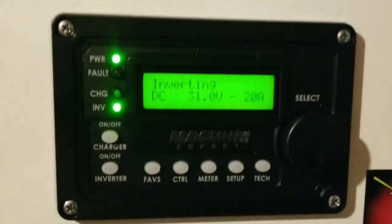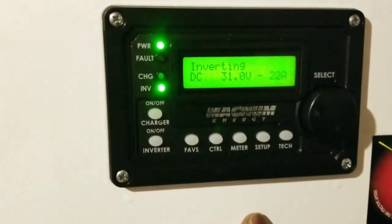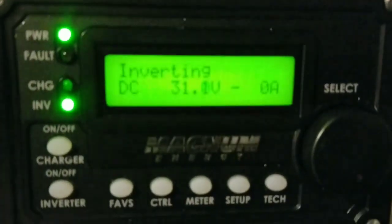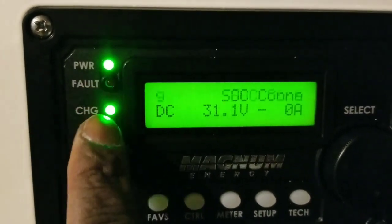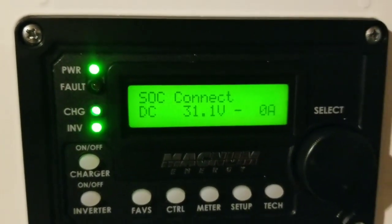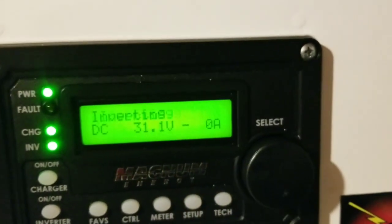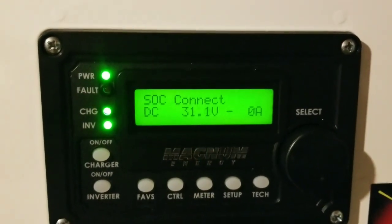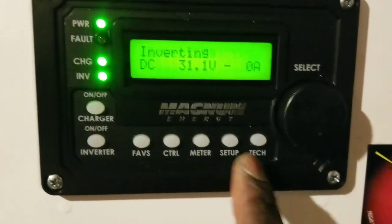So I finally reprogrammed that for Dave — he doesn't have to worry anymore about power, plugging in, or flipping the breaker when he's at work. The batteries drain, so it automatically connects. I can initialize that from here. The AC in — check this out — it's going to monitor the state of charge. Look at the flashing lights: it's saying 'charging' but it's not going to charge, it just monitors. You can see 'inverter inverting' and 'SOC connect' — it's only going to connect at 80 percent when the batteries are down.